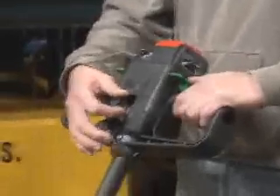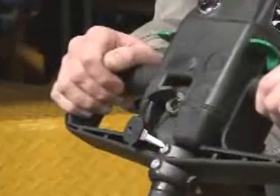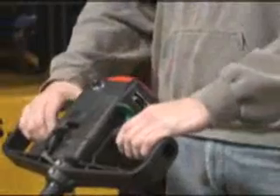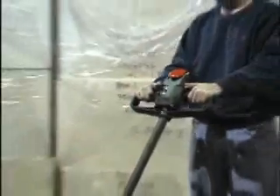A keyed on-off switch allows for maximum safety and security. When in the off position, the traction wheel brake will be set and the drive motor will not function. Turn the key on and utilize the combination throttle, direction, and butterfly controls to move the unit forward and backward.